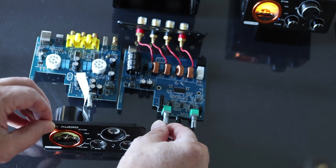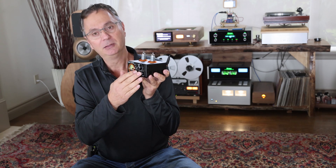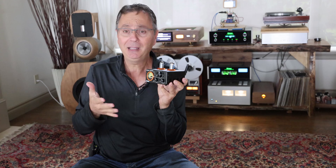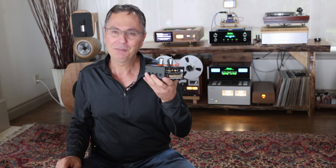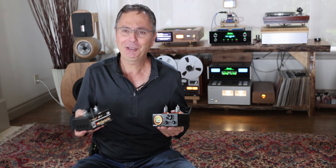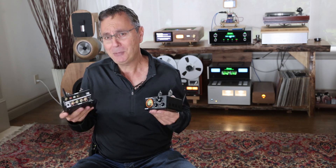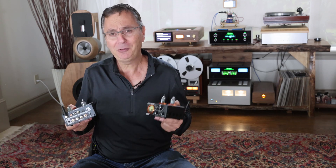These are the tone controls — they come out here, and these are the potentiometers for them. They're decent potentiometers. You still have the bass and treble controls, which comes in handy — your speakers may not be in perfect harmony with the room and you might want to tweak it a little bit. At this price point, I think having tone control is actually a good thing. In this video, not only will I compare the sound of those two units, but as a DIYer I can hook them up on an analyzer, measure them both, and see whether they're really identical or if there are differences. So stay with me and let's find out.